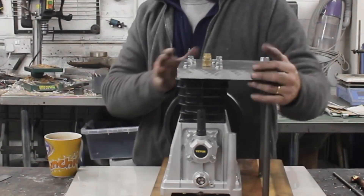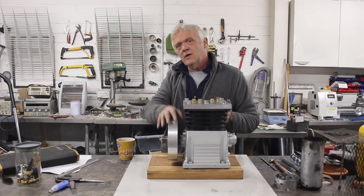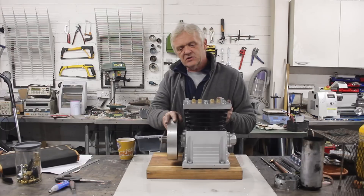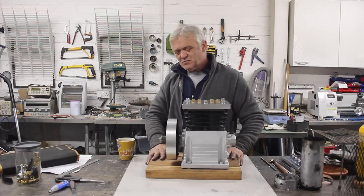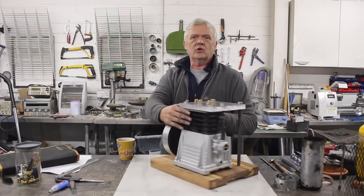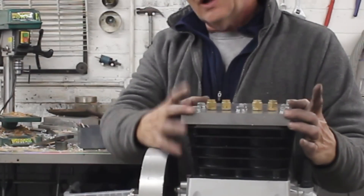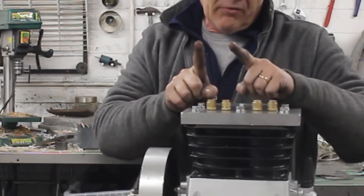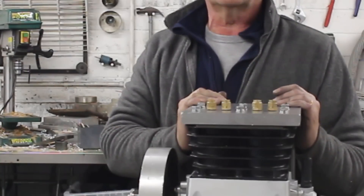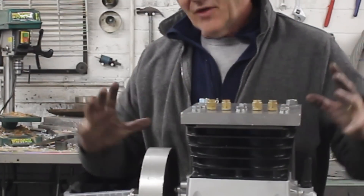You don't need to do an awful lot of what I've done. I had this flywheel kicking around from a bicycle — just use the original. It will work if you don't change it; it might be a little lumpy, but add a bit of weight with concrete or lead if you want to. I put it onto a pretty wooden base with uprights, but none of that you need to do. The essential thing is to take off the cylinder head and replace it with a new plate. That new plate has to have a port in and a port out per cylinder, and that's where the valve is going to go. We've done this to a compressor, but you could do exactly the same thing to a four-stroke — works the same way. If you have a motorcycle engine, you'd be doing exactly the same thing. That's the engine actually complete.